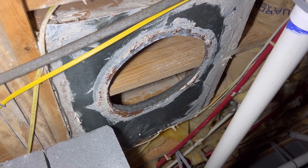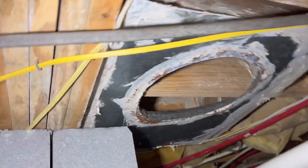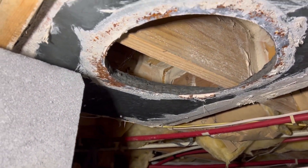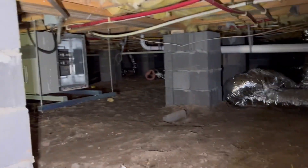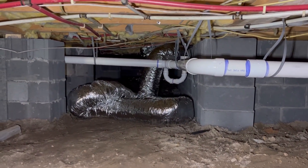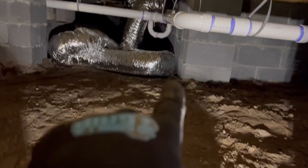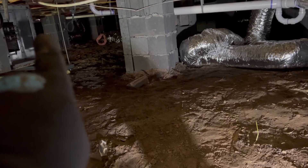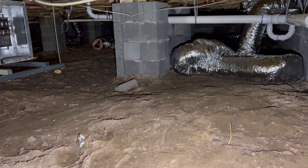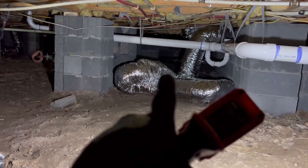Such is life. Assuming I can still wedge it in there with some flex — which I should be able to, not lose too much volume — it's got to come down and run right where I'm sitting and somehow make it to the back of the air handler. Going around the front of the air handler is probably the best way. So if it comes through here, runs that way, then goes straight behind the air handler and into that box in the back, I think we can make that work. We just have to bring the supply — that 12-inch round — underneath it somehow, or weave around it.